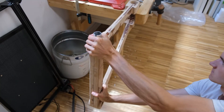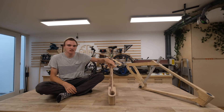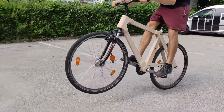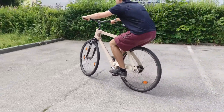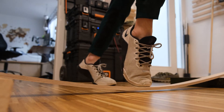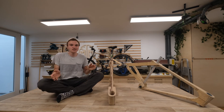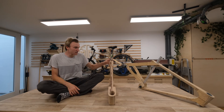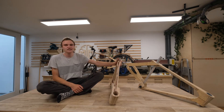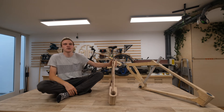The problem is that if you build a plywood bike like this with thin strips as the beams, it becomes very wobbly. Plywood is insanely stiff in one direction, but in the other direction there's a great amount of flex, and this was our weak point. It proved the base concept worked — the back beams were quite nice — but trying to get around the wobble issue meant we'd need so much material it would become insanely bulky, so we rethought our base design.